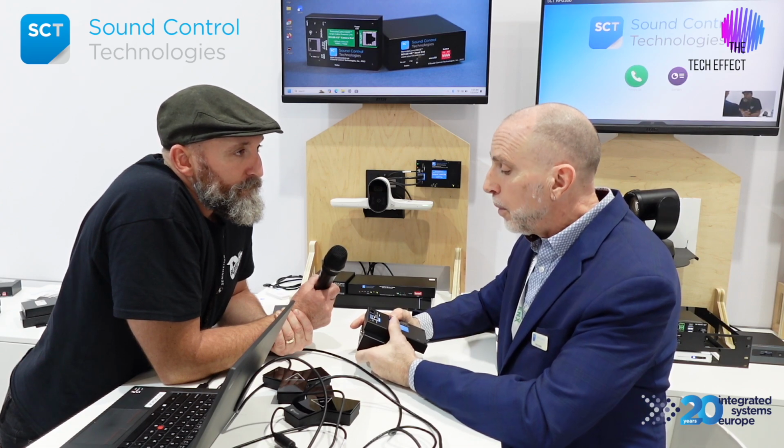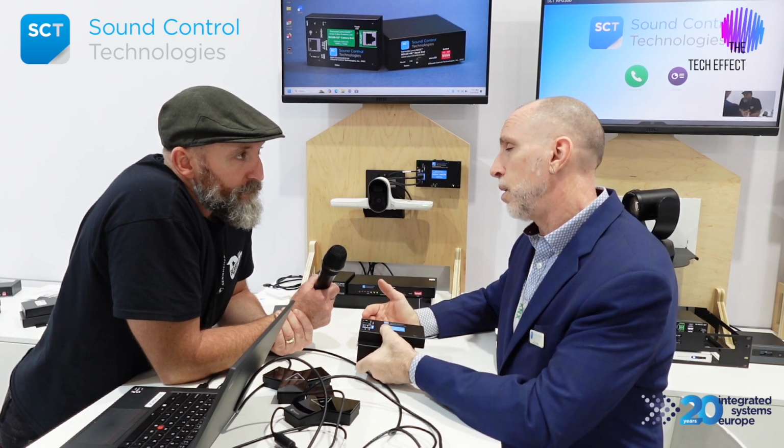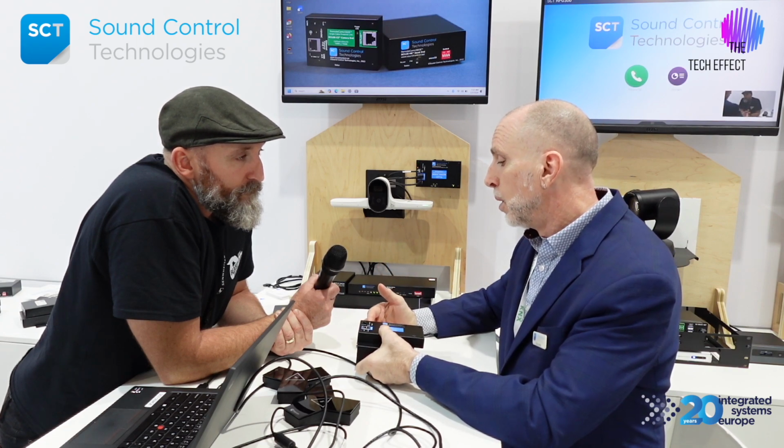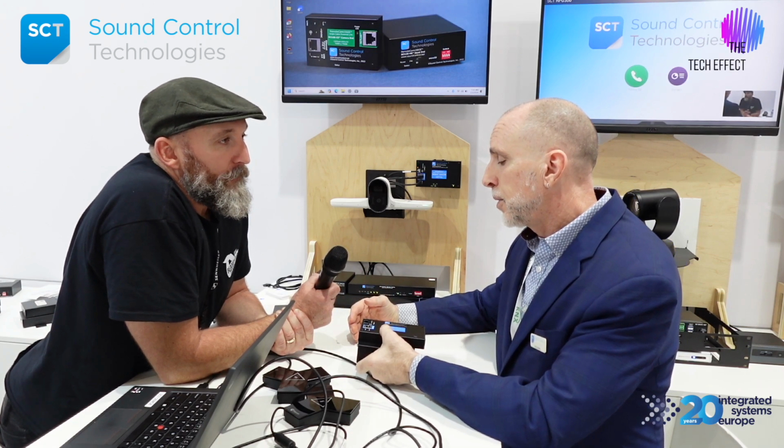However, when we release this kit, and this is also true for the RC5 Plus and the RTK AM1 we talked about, it will go along with a document speaking to the distance you're running. If you're running up to some distance, maybe it's 50 meters, we haven't done the testing yet, perhaps it's only Cat6A. And we know the preponderance of deployments never reach 100 meters, nowhere near 100 meters.